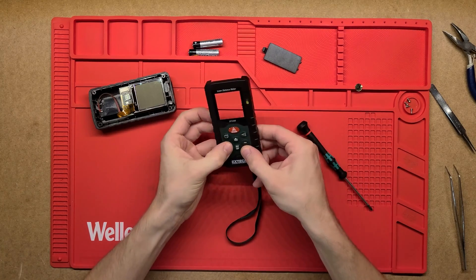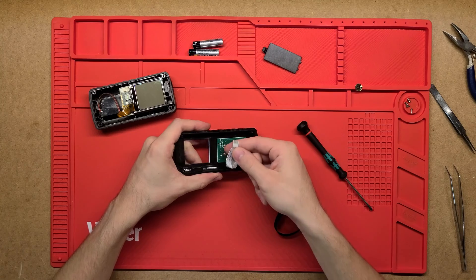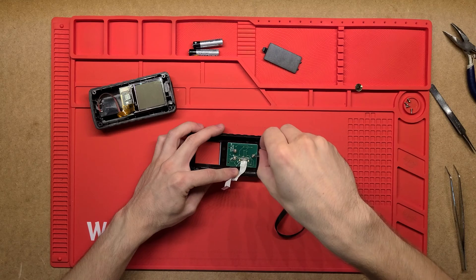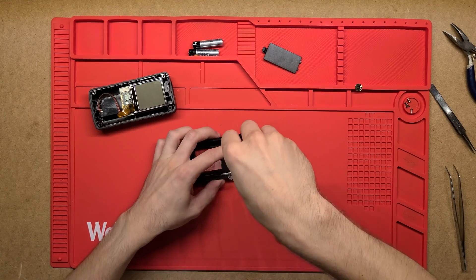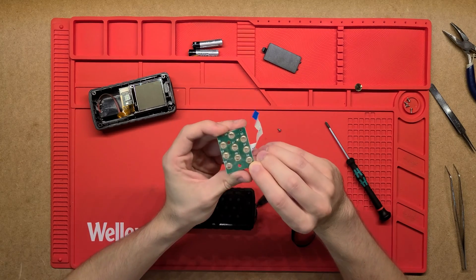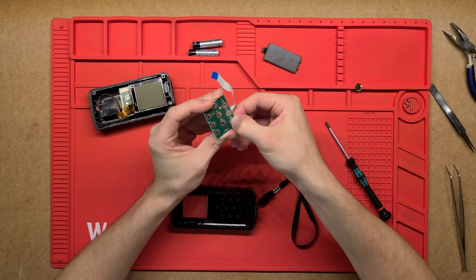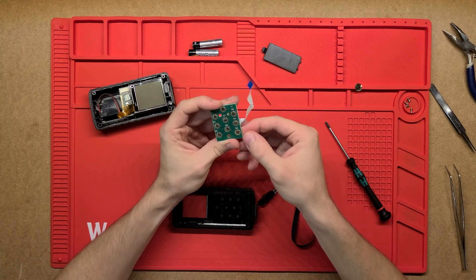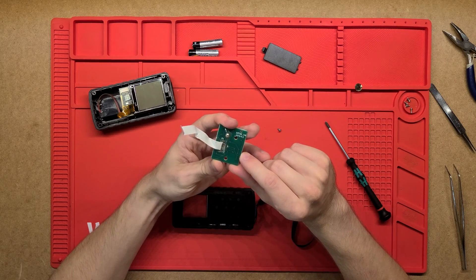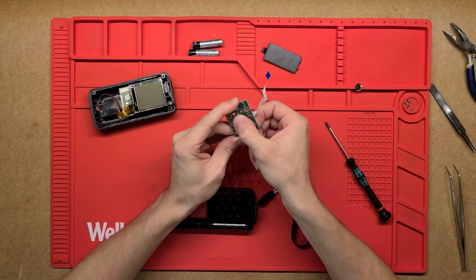This is just the front cover where the buttons are - quite nice click buttons - but a small PCB and just a little ribbon cable that connects it to the main board. The buttons are actually just a simple bit of metal in a convex shape that sit over a contact, and once pressed they just provide a short on that line and feed straight back into it. There doesn't seem to be anything else on this board, just a couple of traces and vias to conduct the signal over to the other side.